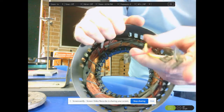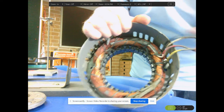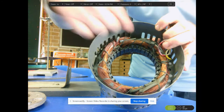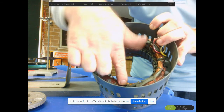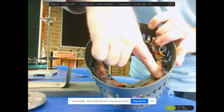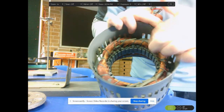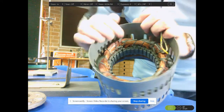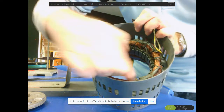We use the AC voltage from the power points, and that normally comes in different phases to switch on sequentially each of these coils. So let's just say we start with this coil up here being north. That means the exact one on the other side is a south. So there's a north-south pair of coils there. Then we'll turn it off, and then we'll turn this one on. So the north would go from being in this position to this position, from this one, to this one, to this one. So the north travels around sequentially.